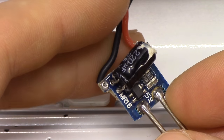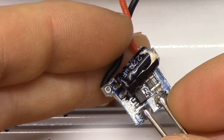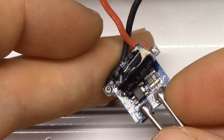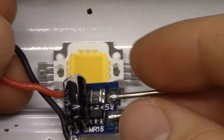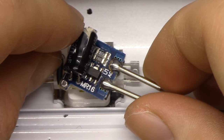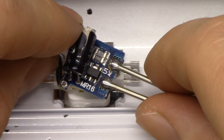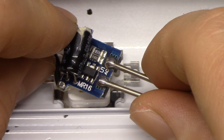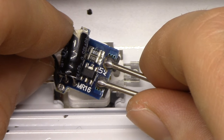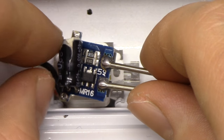The minimum dropout voltage of this thing seems to be about 1 volt beneath it, once you remove the diodes. It's a real fancy little driver — I really like it. And just look at the tininess of the package, it's smaller than the LED itself. I could also, in theory, replace these current sense resistors in order to make these drivers put out different currents. They are specified for driving up to 1 amp and up to 35 volts, so they are really, really flexible drivers.